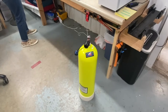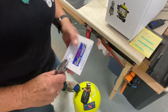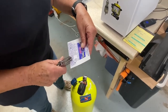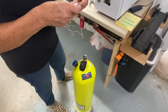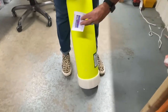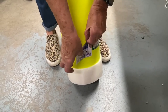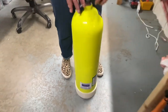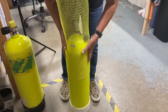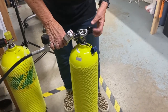The last step is to fill the cylinder with whatever gas the customer wants. If it's a nitrox cylinder, we O2 clean it with our specific process. I hope this helped you visualize what hydrostatic testing is — it's a step that's quickly glossed over in classes but you don't really get to see the full process your cylinder goes through when you drop it off. If you have any questions, shoot me an email at drake@westonfamilycompanies.com or call us at 417-659-9009. Thanks, have a good day!